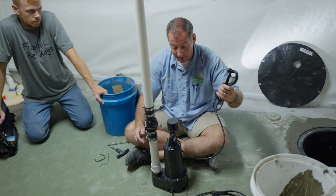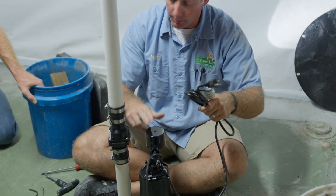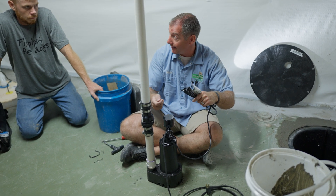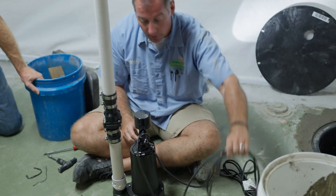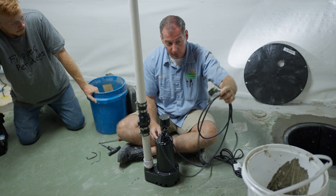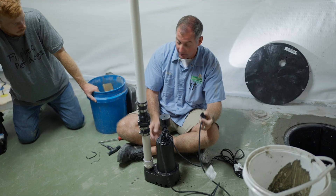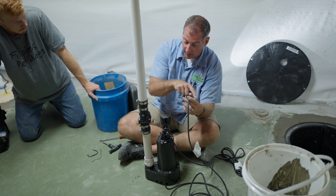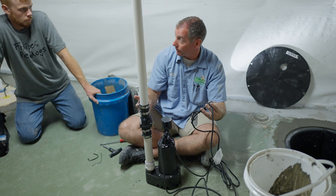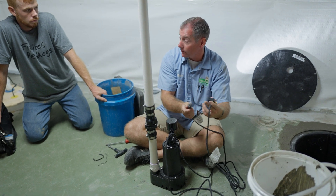This pump has two power cords. One is the actual power cord for the pump — you can follow it straight down into the top of the pump. If I plug this into the wall, the pump comes on and never shuts off. The other cord runs only to the float switch — it does not go into the top of the pump. Inside the float switch assembly, there's a switch: when the float rises, this plug allows continuity to pass through, and the sump pump plugged behind it comes on. When the float drops, electricity stops and the pump shuts off.